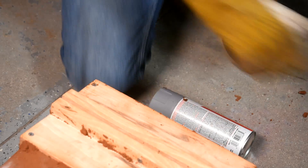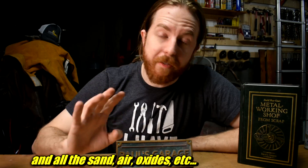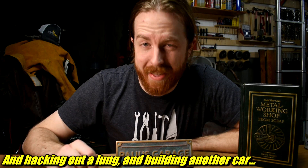So I quickly remembered how it was laid out, and while the metal was still molten, I picked it up and tipped the flask on its side. All of that metal sitting in the runners and the spin trap dumped right into the part. I then started praying heavily and thanking past me for making this flask lock and screw down together. For once, past me didn't screw me over. Sorry that the camera angle doesn't catch this perfectly, or the shock on my face — I wasn't expecting this to happen. Incidentally, this basically renders the spin trap useless, since all the metal in there dumped right back into the part. Okay, for real, I am out of practice. Last couple months I've been busy with a mix of family stuff and traveling. I'm going to officially blame that and not my lack of planning here. Are we all on board with that? Too bad. On the subject of traveling — to the guy I met on the plane who recognized me, it was nice to meet you. That does not happen very often.